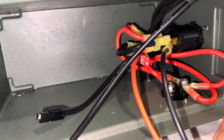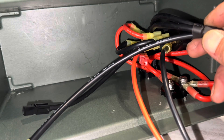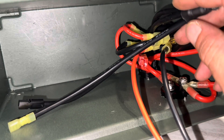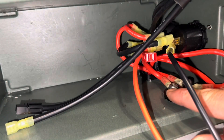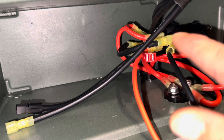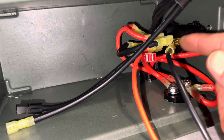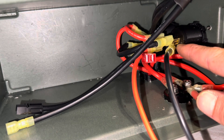I've got the Anderson power poles to quick-connect to the battery so you can take the battery in and out, or use it somewhere else. I used a battery cable butt splice and hydraulically crimped all the negatives together instead of using a terminal block and making another penetration in the box — that's hydraulically crimped with double heat shrink for the negative bus bar. The positive comes in from the battery, goes to the little T-Tokus breaker, distributes off the load side to all the accessories: the 12 volt port, the USB port, and the Anderson connectors with high-temp terminals for the daisy chain.